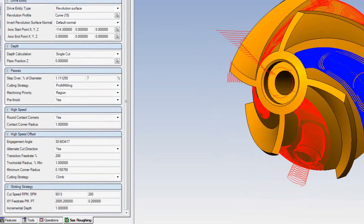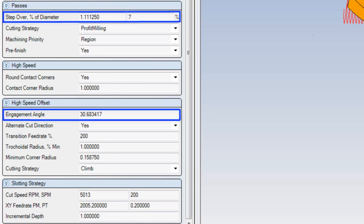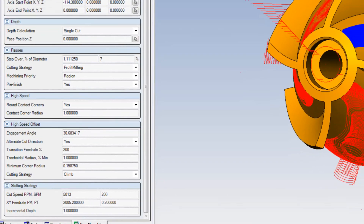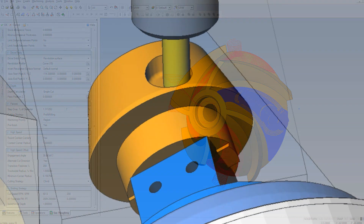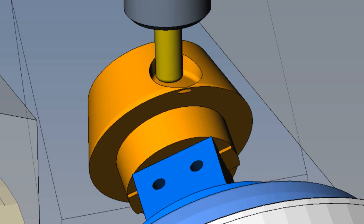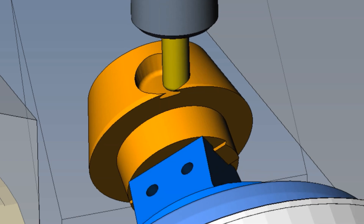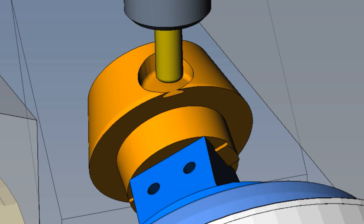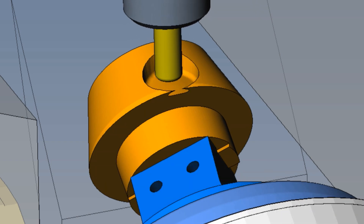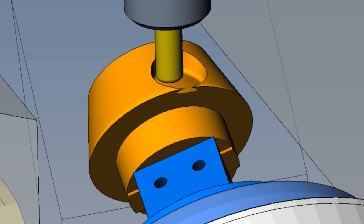With the consistent cutting conditions you'll have a tool engagement angle option, a radial cutter offset, and a constant chip load on the tool. You'll also have a dynamic feed rate — you set a maximum feed rate inside the operation, and then the operation will dynamically adjust it up and down to keep a constant chip load on the tool. The feed rate is also calculated from the tangential edge of the tool, not centerline.